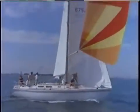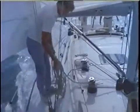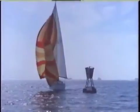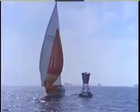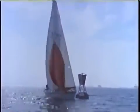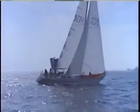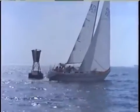First, the chute is carried right to the mark, a big speed gain compared to a normal takedown. Next, the halyard is let go. Don't be chicken, flake it out so it won't foul, and then let it go. One of the nicest aspects of the string takedown is that the sail comes in forward, away from the trimmers who can proceed without having a chute tangled in the winches and jib sheet blocks.